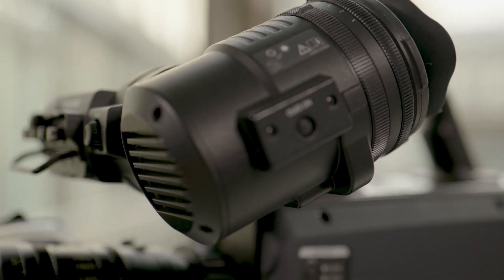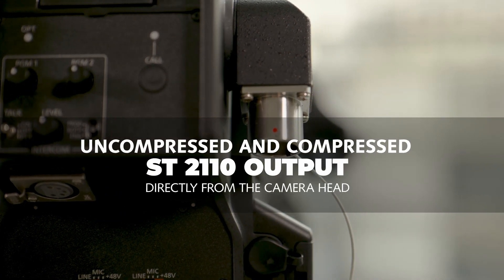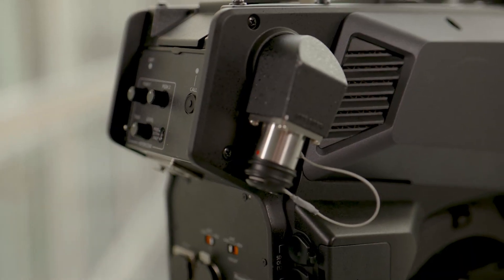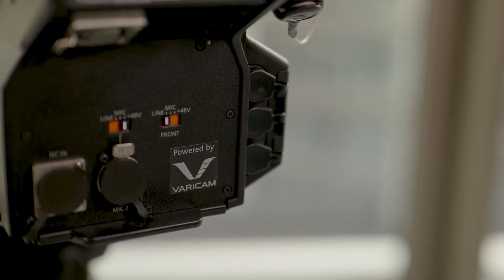Additionally, supporting IP workflows is now a required feature, and all broadcast environments are designed to integrate the advantages of a real IP environment. Normally, live production with cinema cameras requires the use of many external devices, but with the AK-PLV100 only the standard camera is needed to build a fully operable system. The AK-PLV100 supports ST2110 directly from its camera head and merely requires an optical fiber connection for main video trunk signal output, reference input with PTP, return and prompter input, as well as bidirectional audio connection for intercom, camera microphone, send and program audio returns. Camera control data can also be routed in-band over the same IP connection.